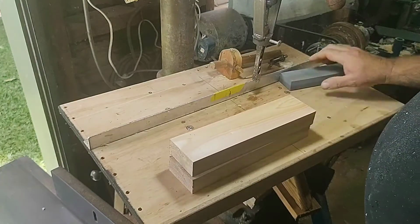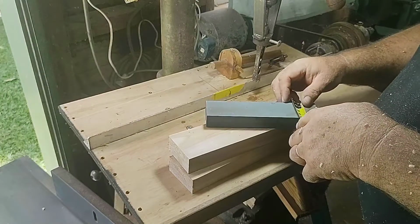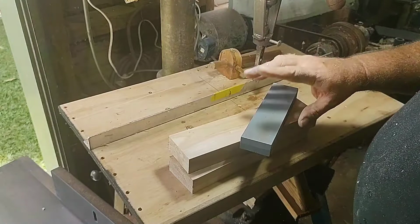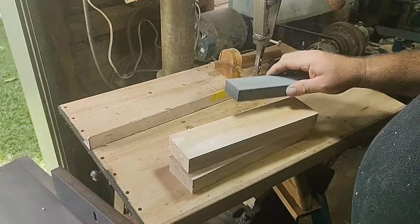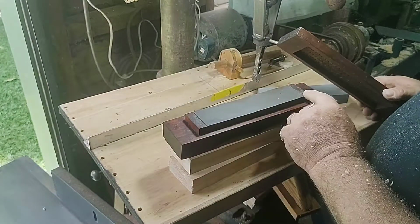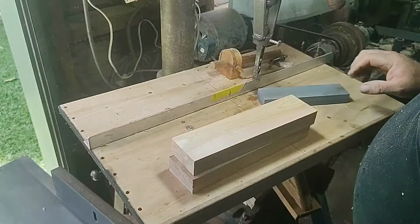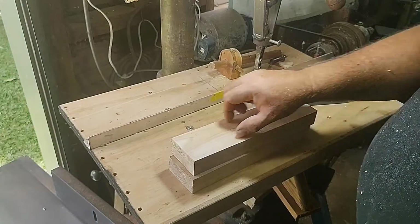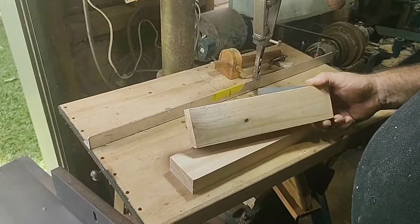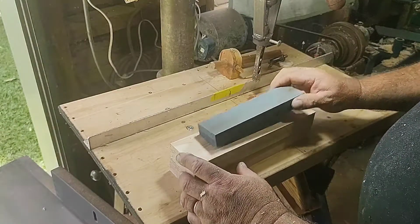So first thing we need to do is measure our stone up. In this case, 50mm by 200mm. Now I'm going to allow a little block at either end like on this one, which is actually quite a good little idea. I won't make it as fat as this. I'll probably only make them 10mm. So I need to make a hole in there, 50mm by 220mm. So 10mm longer at either end.